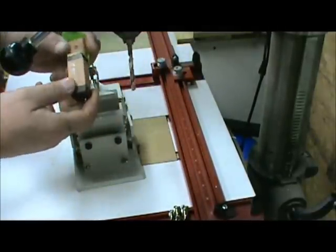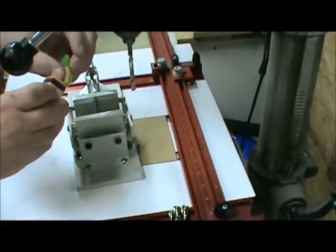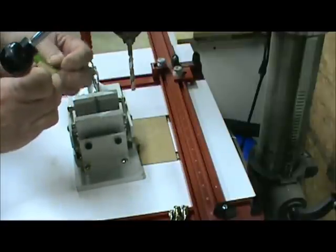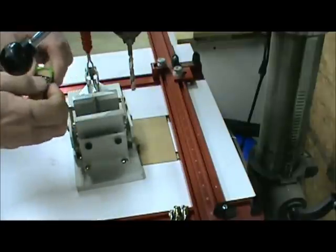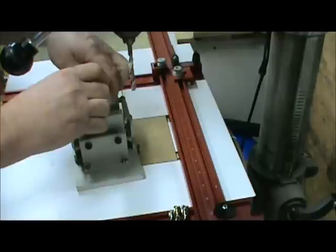And there's our 1/4-inch hole all the way through the last piece there, and you leave this piece of stuff taped on there, is that correct? Yeah, the whole process. That way we don't have any breakout when we go through with the next steps. All right, so I'll just put that back in there.